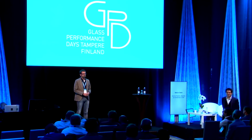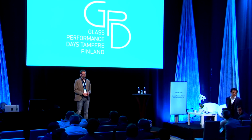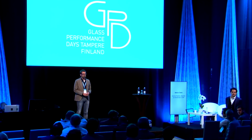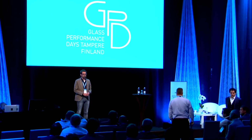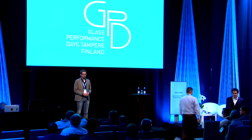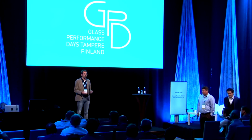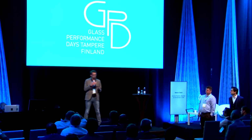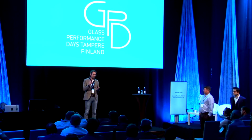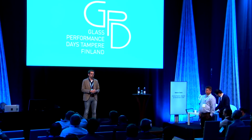Hi, Martin. Just a quick question. Why did you end up shipping the pieces, the glass of the IGU, to Hong Kong and then assembling it there, rather than attaching it to a breather system or a desiccant system for transit and manufacturing it in Germany? It would also be possible, but mainly to minimize the air and the time frame where we need to condition it. We want to minimize this, and this is the reason why we assembled it in Hong Kong. Could also be done in Germany theoretically.